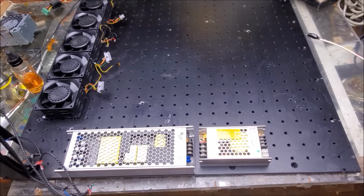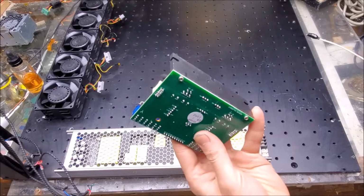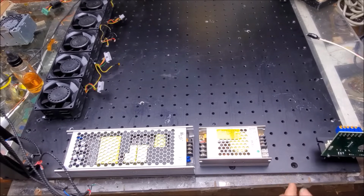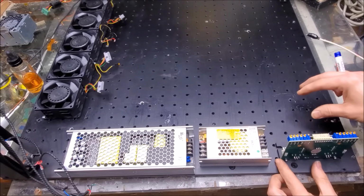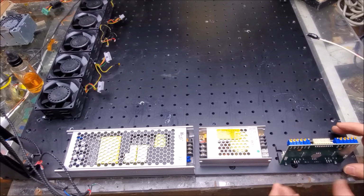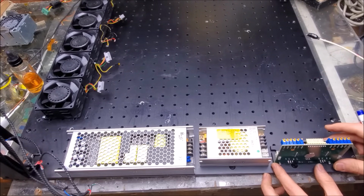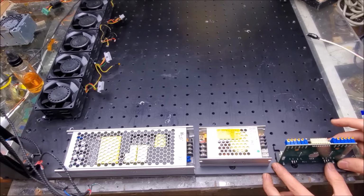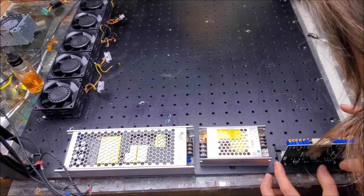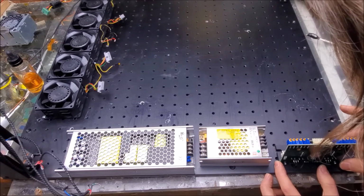And then we have the galvanometer amplifier. So that's that right here. And we're going to put this down near the output side of this power supply, and right by where the galvanometers are going to be in this section. So once again, along this edge here, make those wires pretty short. Let's center that here. Make it look nice where those will line up.